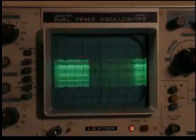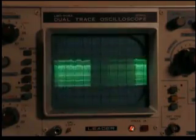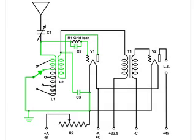You can see that there's quite a bit of carrier there. This is the regen part of the radio. The signal on the grid of V1 is amplified and comes out on the plate, which goes down to the bottom of L2. As that magnetic field expands, cutting across L1, it gets fed back in phase — positively — back onto the grid. It can do this somewhere in the neighborhood of about 1,000 times, so it's a very high gain amplifier.